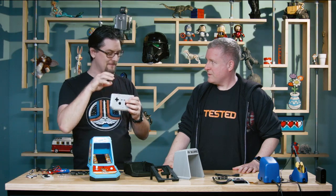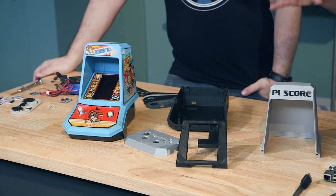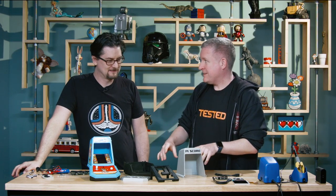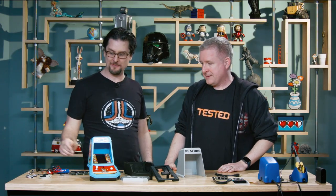The back was not so much — that was a lot of caliper work. It was literally nudging things by fractions of a millimeter, and I was getting a little punchy and made some dumb mistakes. But in the end — eight different versions — we have it. Whenever I have to do any kind of modeling, I scan things with a flatbed scanner — I don't know if that would have done the trick for this or not. We discussed taking reference pictures with a telephoto, but it's really hard to get dead-on and there's some parallax no matter what. I never thought about doing a flatbed. It works with objects that are flat — this isn't flat, but it's a possibility. I'll keep that in mind for next time.